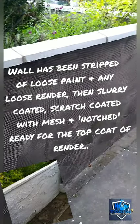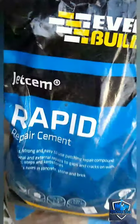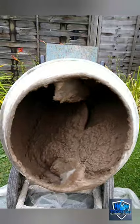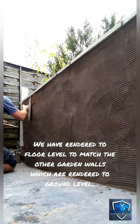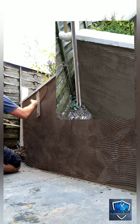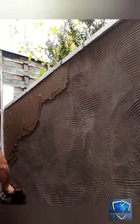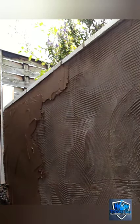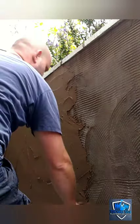The coping stones are stuck back on, so this morning we want to get in and get out. It's ever such a small job, and the situation with cement render — especially if you haven't got sunshine on your side — it can just hang around forever. Behind this wall is a planter and I don't think there's any damp proof membrane, so I've advised getting some weep holes drilled at a future date once the render's set and decorated.